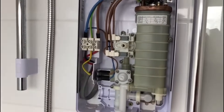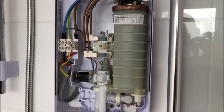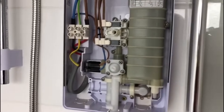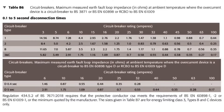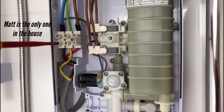You can see we've got the electric shower here. I've taken the front cover off and done a ZS earth loop impedance test, which came up at about 0.76 ohms, so that's okay. It's not live at the moment — I've isolated it.